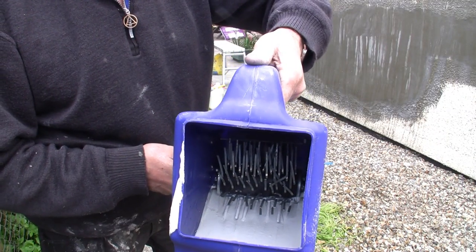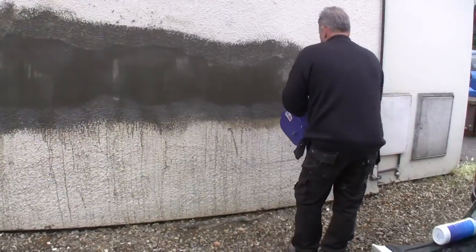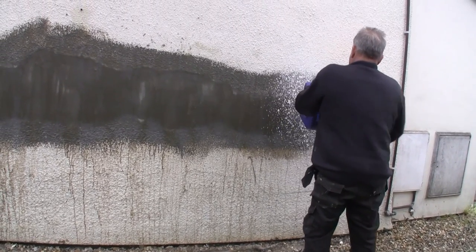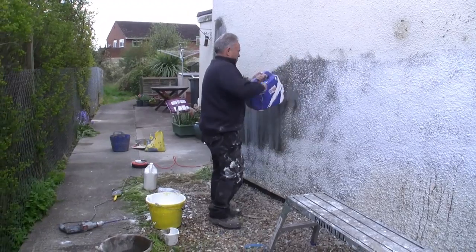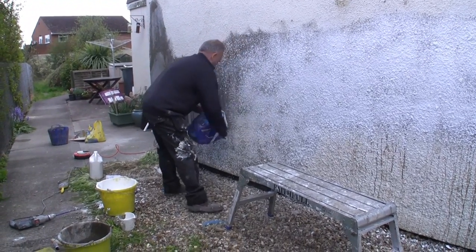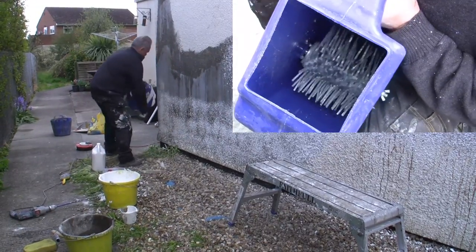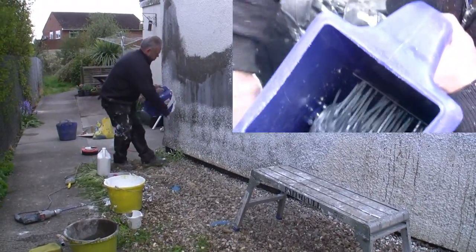It sits in the bottom of the container and you can see those little prongs. They are flicked when the handle is turned and it sprays the Tyroleon on the wall giving you a textured finish. You'll see in a bit how that spray action can be adjusted. You move up and down the wall, keep spraying, and keep an eye on the existing surface that you're spraying up to, so that you can adjust the flicking action to get the right sized blobs of Tyroleon. The gun in the top right-hand corner shows you how the prongs flick the Tyroleon onto the wall.